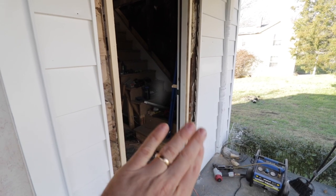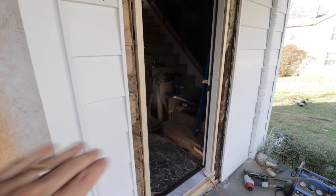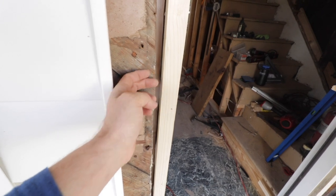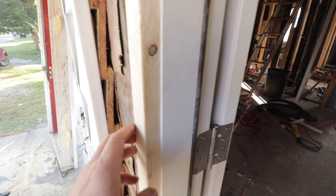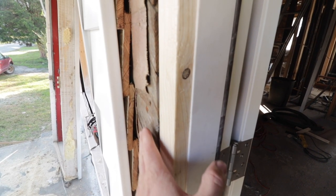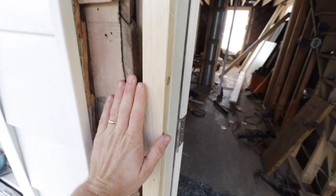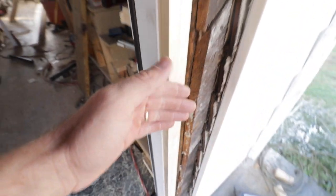With this wall being thicker and setting the door flush with the inside so it could swing all the way past the trim flat against the wall, I have to build out the door jamb just a little to get out flush to where a trim board can go right here all the way around the door. So that was ripping a 1-inch thick strip that gets me just past this surface. It's a little uneven since it's just rough sawn boards for the most part, so I went out past it a little bit on its furthest. Sticks out the most right here. So it'll be flush with this, and then basically just going to be a 2x6 that goes around.